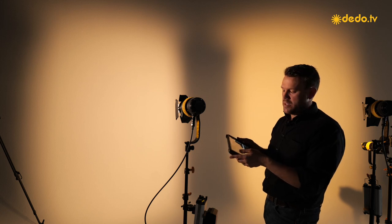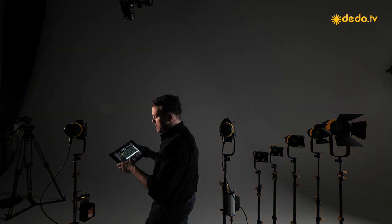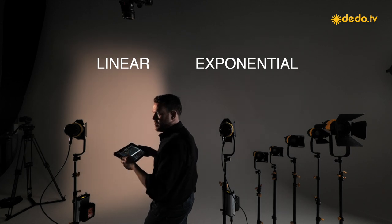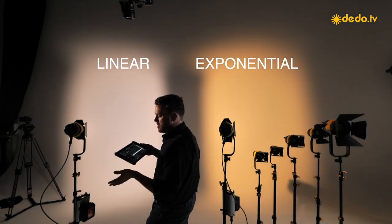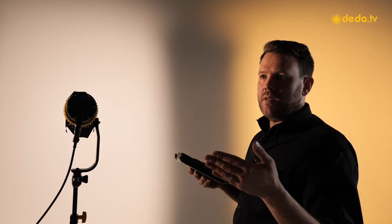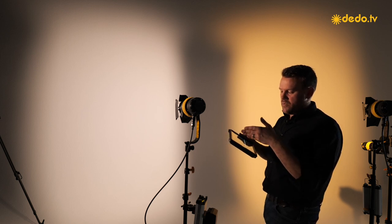To show you visually the difference between linear and exponential mode, I've set up three looks. Look number zero is always the blackout, and I'm driving both units at the same time to 50% now. You can see how the unit on the left, which is in linear mode, kicks in much earlier than the unit on the right. Continuing to 100%, you'll see the impression that the left unit hits 100% much earlier — we're at 80, 90, 100 right now. So you have much more control of subtle lower-end dimming on the exponential curve, depending on whether you need extended control at the lower end or prefer the linear mode. The Timo 2 enables us, without any additional tools, to have the iPad control unit number one via Bluetooth and then enter the CMX ecosystem.